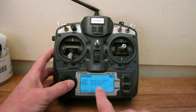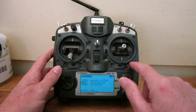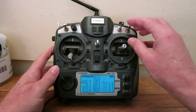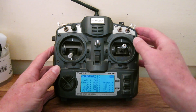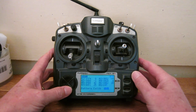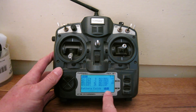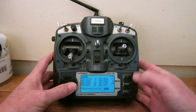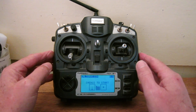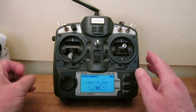This screen shows the software version — this is OpenTX revision 2940, which is as far as they went with this radio. You can also check all your switches on a debugging page. There's a battery calibration page where you can measure battery voltage with a multimeter and calibrate it within the radio so it gives the correct reading. And there's a calibration screen for when you flash new firmware, letting you recalibrate all the switches, knobs, and controls so they work properly.